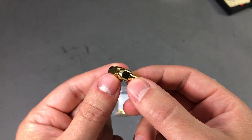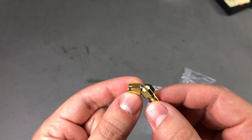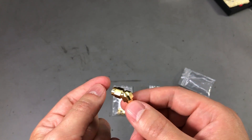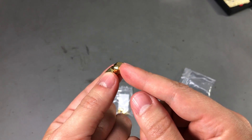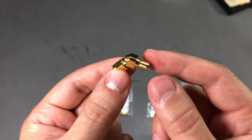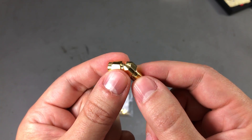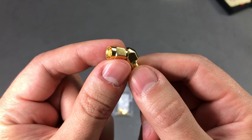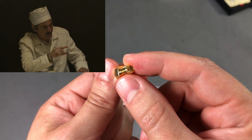Next I have a small 45-degree angle female-to-male SMA adapter. I got this from AliExpress and I know it's kind of low quality — it adds quite a bit of loss in the transmission line and it's not really rated for anything above 2.4GHz. It's not ideal but sometimes you really need it when you have an odd antenna that doesn't quite fit a receiver. The quality also affects how many cycles you get out of these — they're good for up to around 200 cycles, after which they start to lose the plating and the center pin connection is not as tight as before.